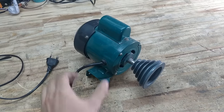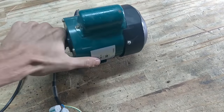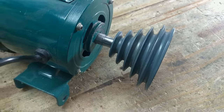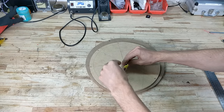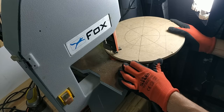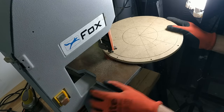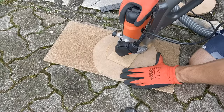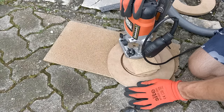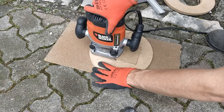You definitely want your rotor to spin at around 3,000 rotations per minute. A four- or six-pole motor will run much slower, and the siren won't get loud at all. So let's start out with cutting the mounting discs out of 16mm MDF panels. To get the center holes cut out, I used a router. These will hold the stator parts in place.